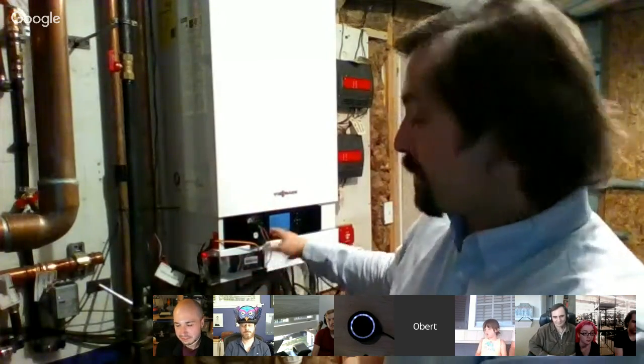And I discovered it has a funny little logo in the corner, which I've got covered up with tape, so it really won't show up. It's a German propane boiler. And the little logo with a little LED that shows when the power's on turns out to flicker. And it flickers because it's actually a serial port. It flickers in infrared, and it speaks in optical coupled infrared.